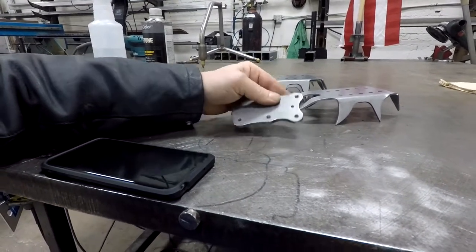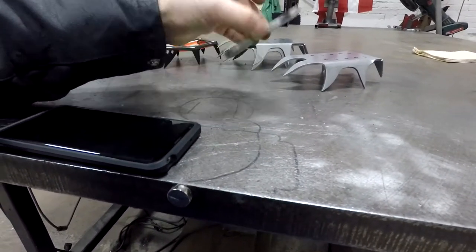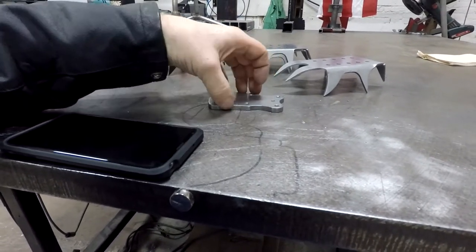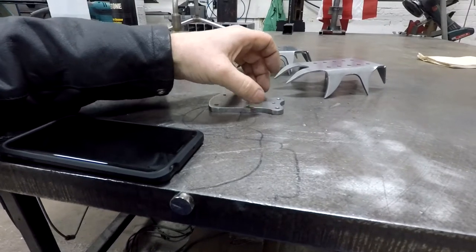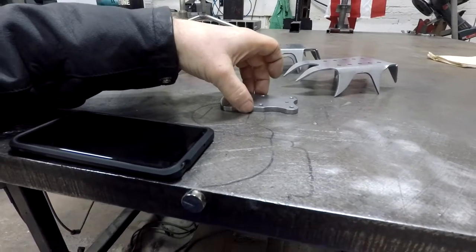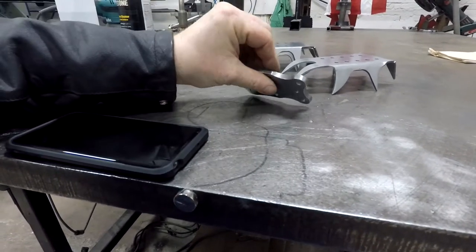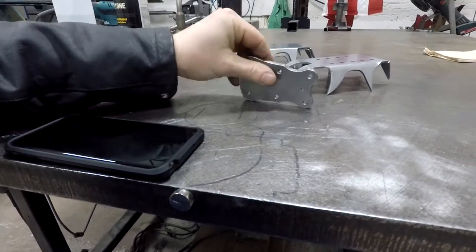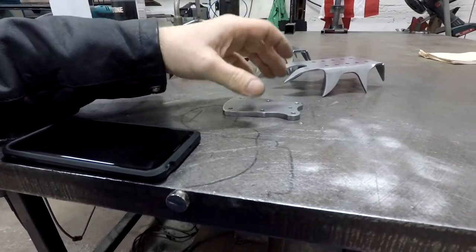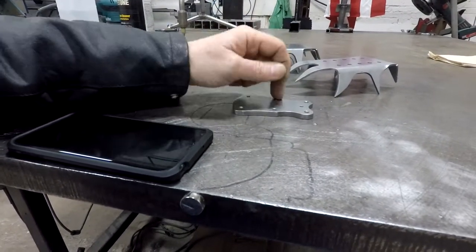Drilling and tapping these things — that would be more ideal in the CNC mill. The problem I've run into in the past, if I want to do that, is every time you cut these, they're not perfect. You're going to have a little bit of deformation at the base or whatnot. So if you put them in and clamp them down into a set of soft jaws on your vise, it's going to be cattywampus a little bit. If I clean them up in the tumbler and get a good surface on it, it should clamp good enough in soft jaws that when we drill this out on the mill, it should be fine. And then I can tap them.